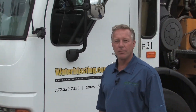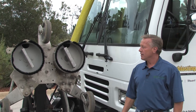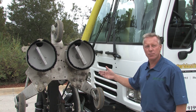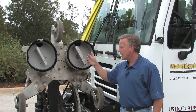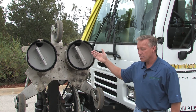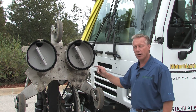When the water exits out the pump, it comes up here to the front to what we call the hog heads. This produces 12 gallons a minute, six gallons a side. There are several different spray bar configurations we can use. On here right now we have a more aggressive in the front, less aggressive in the back, like 80 grit sandpaper and 220 grit sandpaper. So the front bar can effectively remove the material and the second bar can smooth it out.